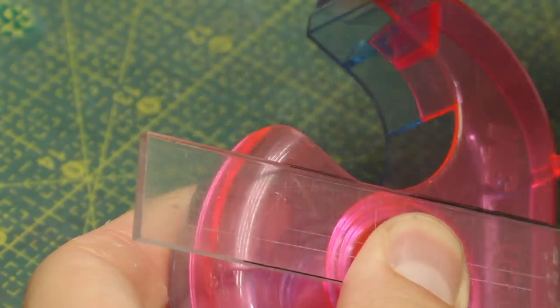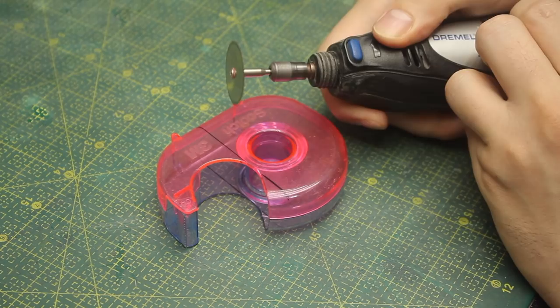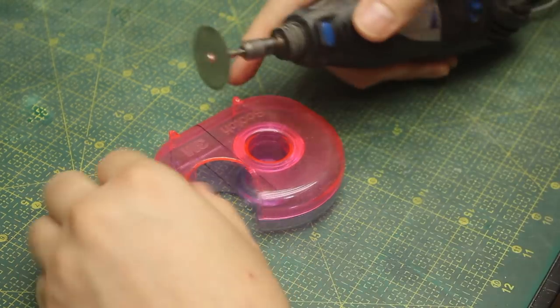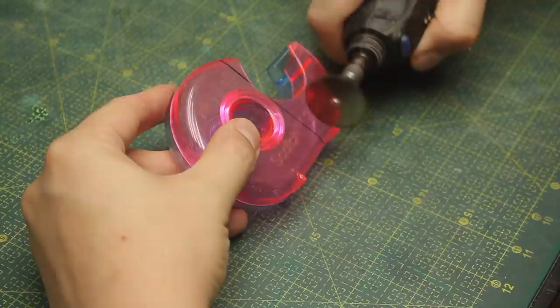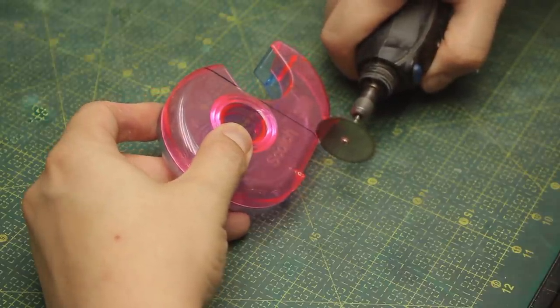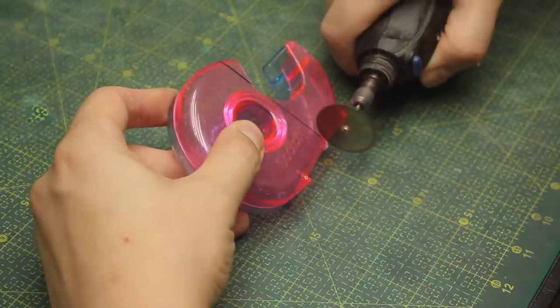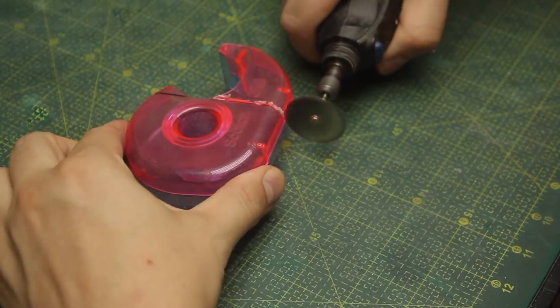This tiny angled part here - I'm not even sure I'm going to trim it down, but I'll put some lines here and decide about it later. To cut it precisely and fast I'll use my Dremel tool with this spinning blade. In plastics I just have to be careful not to catch the blade into the molten plastic, because that could throw the blade in the direction of my fingers - that would be an ugly scene.